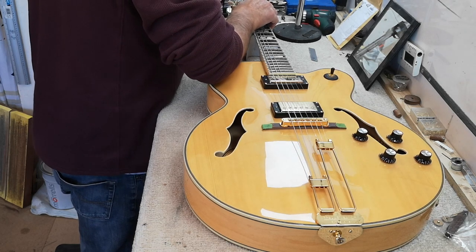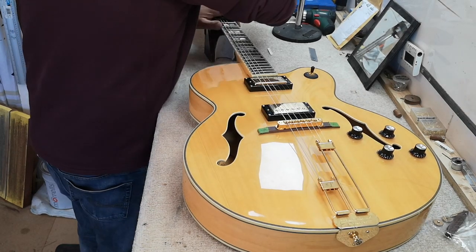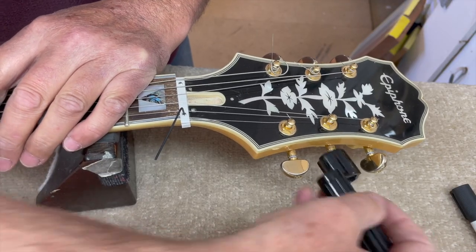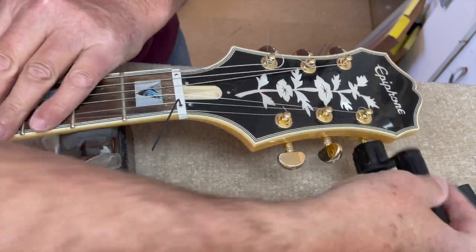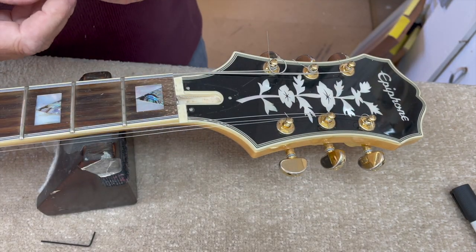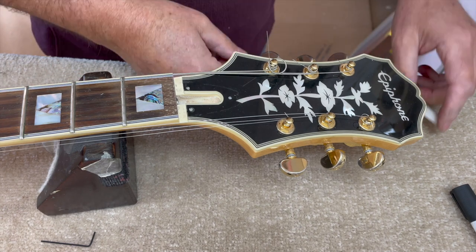And that will go hand in hand with something else I want to do, which is to round off the bottom of these grub screws before I stand them onto the 3D printed plastic. They're standing on it now, but before I turn them and tighten them. So let me just take this out. I'm happy with this. This is very flush. That's a really good fit. I haven't actually had that good a fit before.